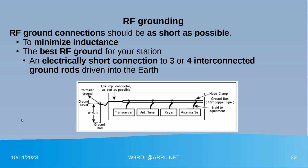So actually, I got a question here. We live in Florida. Behind my house, there's a drainage canal, and there's always water in the drainage canal. That leads me to believe that the water table is probably not very far below my house. Probably not. Everything that I read says that you need to have an 8 foot grounding rod. That's kind of standard length, 8 or 10 feet. Well, I've got 2 4-foot grounding rods left over from when I used to do satellite system installations. You're fine. It's better than none, and 2 of them better than 1.